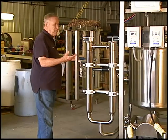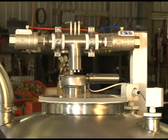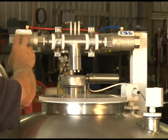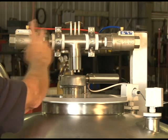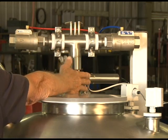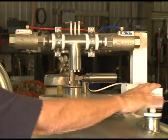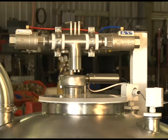Other than that, not much else to talk about other than the input group. During milking, the group has to be tightly closed; for washing, it has to open automatically, close automatically, and seal. We do that with this group. Hot water valve — one and a quarter inch, by the way, not the typical half inch or three-quarter inch everybody else uses — cold water valve, and then the chemicals come right from the top and mix with the water as needed. The group opens automatically, and once the water level sensor says we have enough water, the group closes automatically. Vacuum pump starts and milk pump starts.